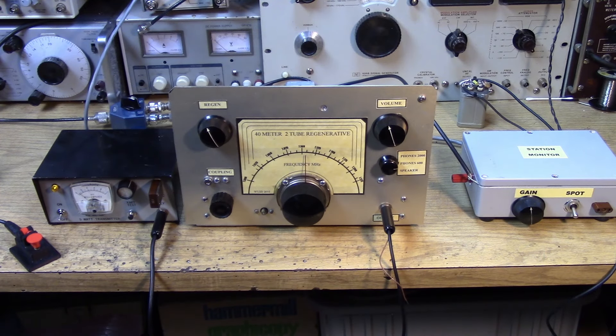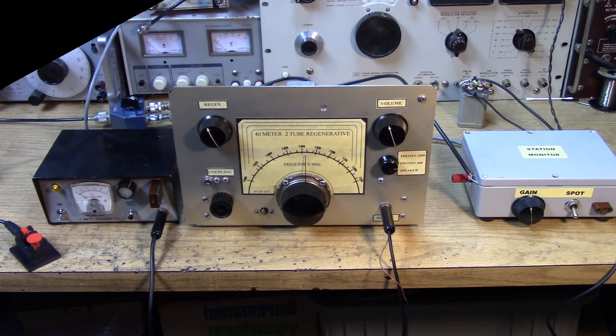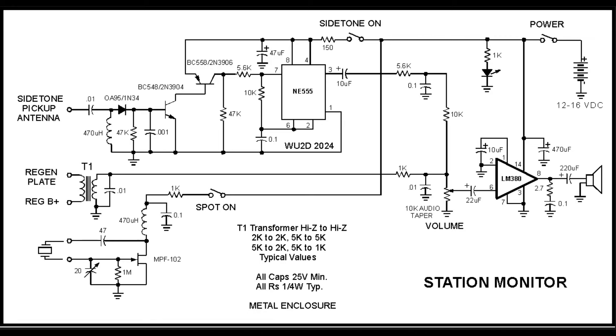That's not the way Grandpa solved it. In the next video we're going to learn what they did back in the 20s to solve this situation without resorting to integrated circuits and transistors. Here is the station monitor's schematic - basically what I was using at Bear Brook. The first thing I was trying to do was find out what frequency my crystal was on with the regen. By taking the crystal out of the transmitter and plugging it in here, I could turn on this little oscillator, which is nothing but a JFET, an MPF-102, in a Pierce configuration.